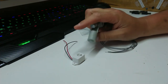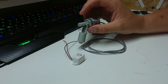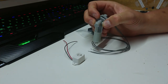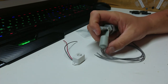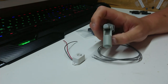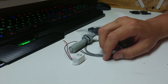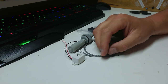I don't have two of them, but I think I should be able to refloat it with a 2,000 gallon per hour pump. But I'm going to stick this little guy somehow near the bilge pump up the front there, so that if we start getting water in there, I can tell before it starts coming through the floorboards. I think I've done my homework, and I think I'm going to have about 150, nearly 200 litres before I see it coming through the floorboards. Considering the capacity on fresh water of that is about 380 kilograms. I'm 140 kilograms at the moment, would you believe? I do need to lose a couple of kilos.